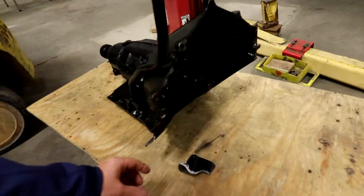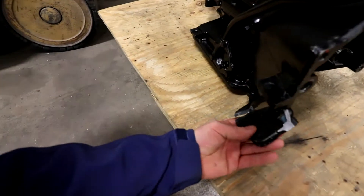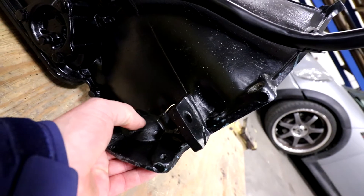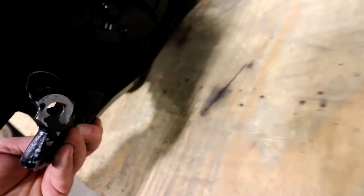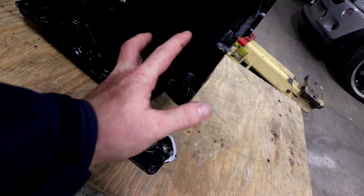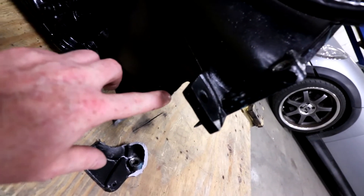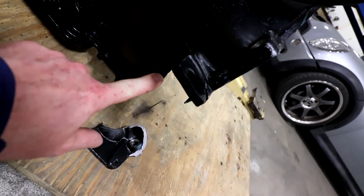With aluminum, don't be afraid to go back over and weld it multiple times. Same thing with cast welding — like this transmission piece. When it gets put in, I'll grind and bevel these edges down on the outside, and probably the inside depending on how well I can get in there. I'll lay a bead down as best I can, but it'll take a while to get warm so the weld won't be the prettiest at first. With cast I like to then go back over it and manually foot-pulse.